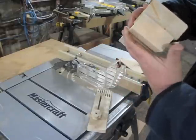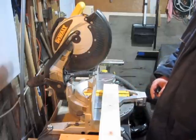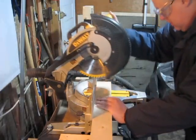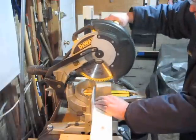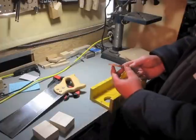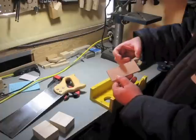So I end up with something like this — a nice square side instead of these rounded-over corners. Next I'm going to cut off two pieces two and a half inches long. Then I'm going to take this piece of quarter-inch MDF and cut it in half — that's going to give me two pieces that are two inches by about two and an eighth.